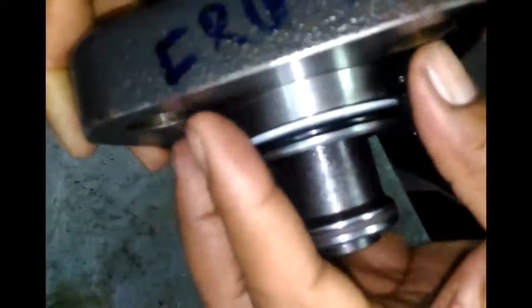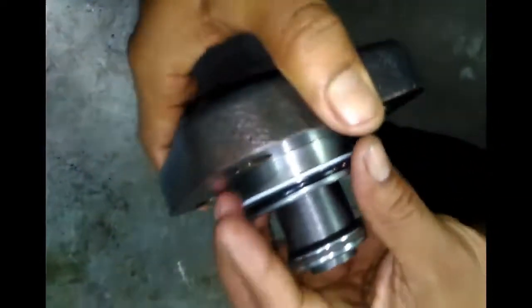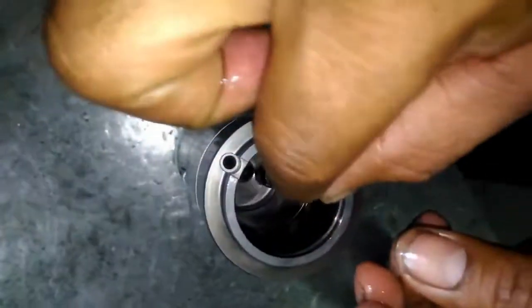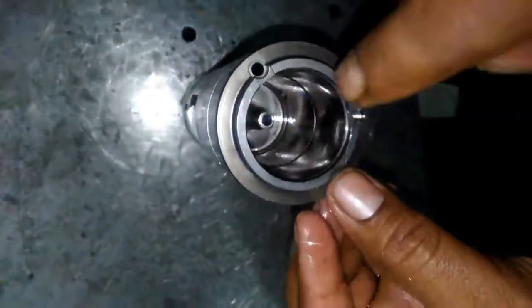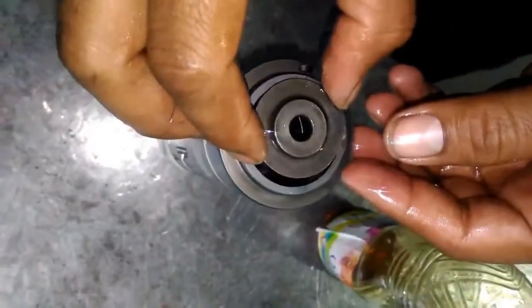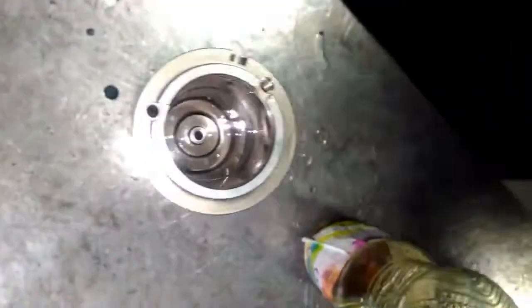You can see the piston is up and down — meaning vacuum is being created or oil is being delivered. The piston cap — we are putting a backup ring and O-ring for sealing of hydraulic oil. This is the backup ring. This is the servo piston, and we are putting it inside the PC valve spool.